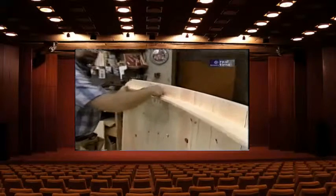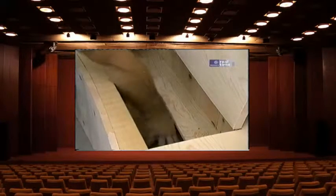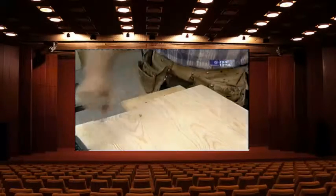Before I actually cut out this seat blank, I want to point out that along the back there are three more pieces with the same radius as that seat: this top member, this piece right here, and another piece under the floor of the chest. I could try to put all four pieces together and run them through the bandsaw, but the piece is a little too big and it would be very awkward. So I'm going to use my electric jigsaw. I can only really cut two pieces at once because of the length of the blade, so I've taken a piece of 1 by 10 and fastened it underneath the seat blank — as I cut along my radius line, I'll end up with another piece that will become the top cross member.